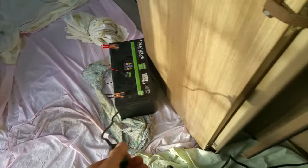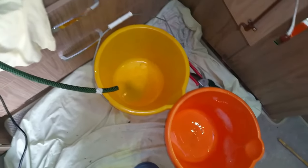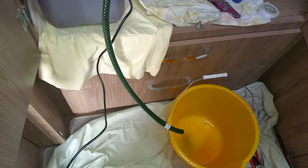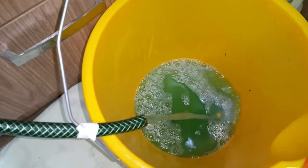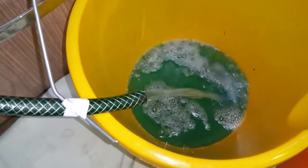I've connected my battery and I'm ready to switch on. I've brought in an extra bucket in case we flush through more than one bucket holds. The old coolant is a greeny colour and the new is a sort of purple colour, so we'll keep going until we see that. It would probably help if the hoses were clear, but I haven't got any.